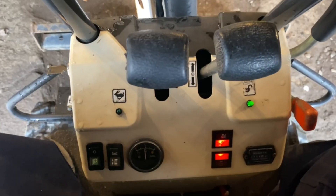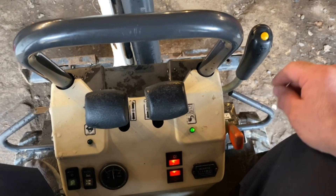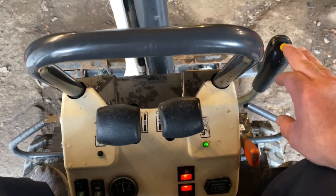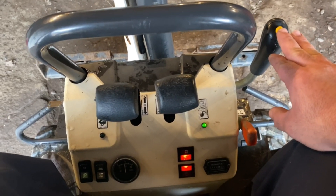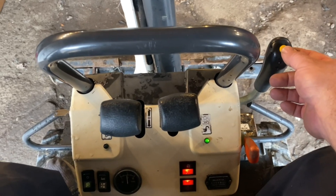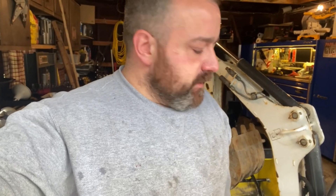With the key back on, when I press this, that light comes on solid. That tells me my old module was bad because now with the testing relay in place, the circuit works again. What's not working is the latching function — where you tap it on and then tap it off. But this allows me to troubleshoot it that far, so now I know the switch is working, the wiring to that relay is working, the light is working, and when I drive it holding the button down I get higher speed, so the two-speed hydraulic solenoid is also working. I got the schematics for this circuit, and that's what allowed me to install a relay in place of the two-speed module because the schematic showed me which wire is which in that five-pin harness.